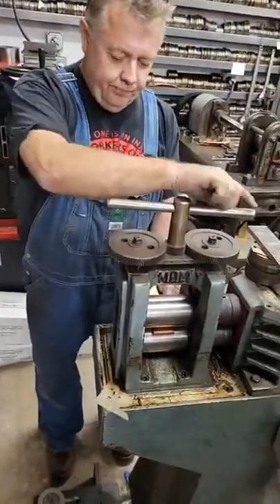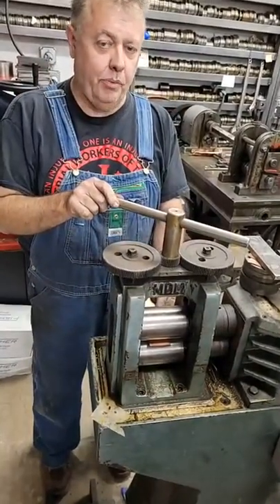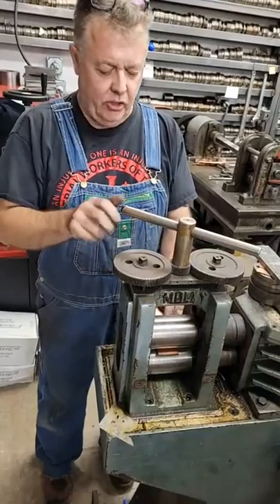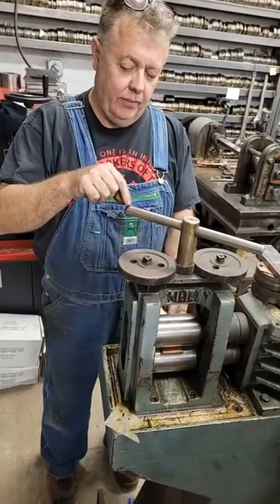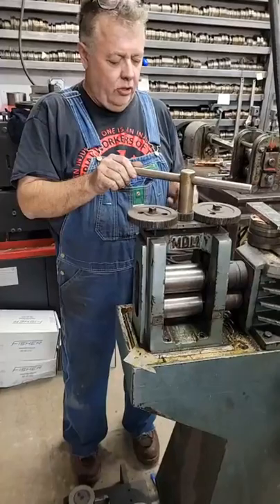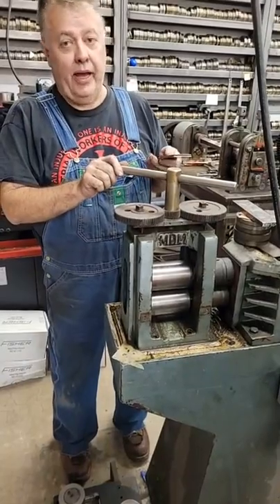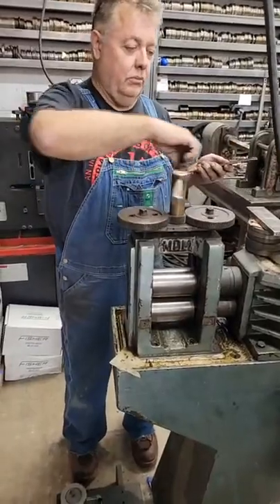So when you set this up, you're going to need to bring your handle all the way down and make sure that you take up all the slack. This is where people mess up — they crank it down but they don't take all the slack out. They just get them to touch. You actually want to get it pretty tight. So make a mental note of where your handle is. The way I like to do it is I hold on to this handle and I spin it around all the way back. Now I bring it all the way back around. So now we're at the location where this was fully closed. I'm going to put half a turn on this — just half a turn. So this is going to end up right there.